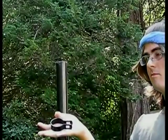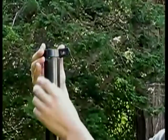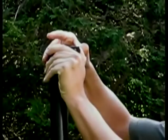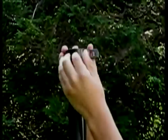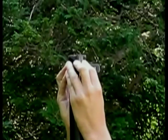Next, take a brace band and remove its bolt. Slip it over the top of the post and pull it down snugly. Every post you put up should have one brace band. They are used for stringing top wire, hanging fencing materials, and are part of the earth anchor bracing system.